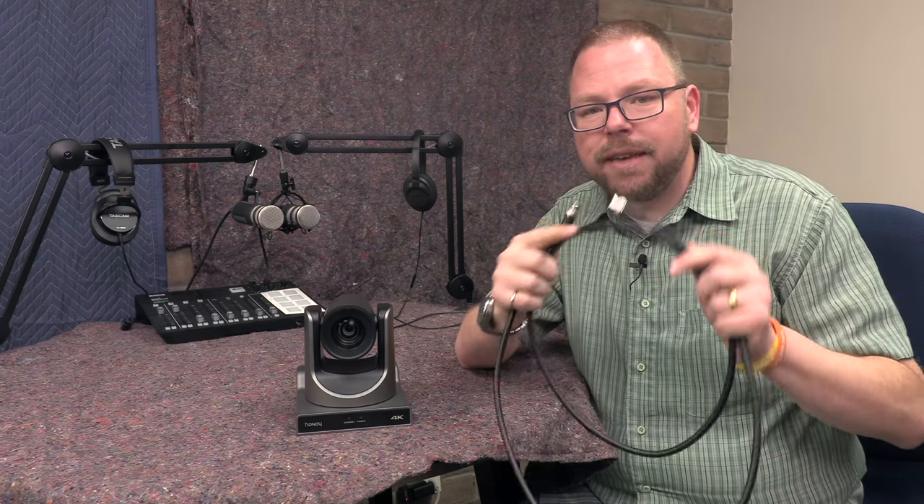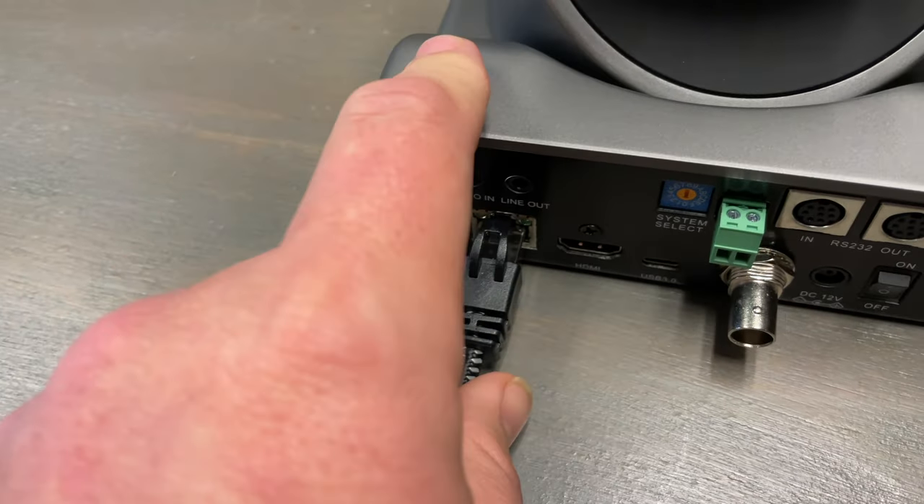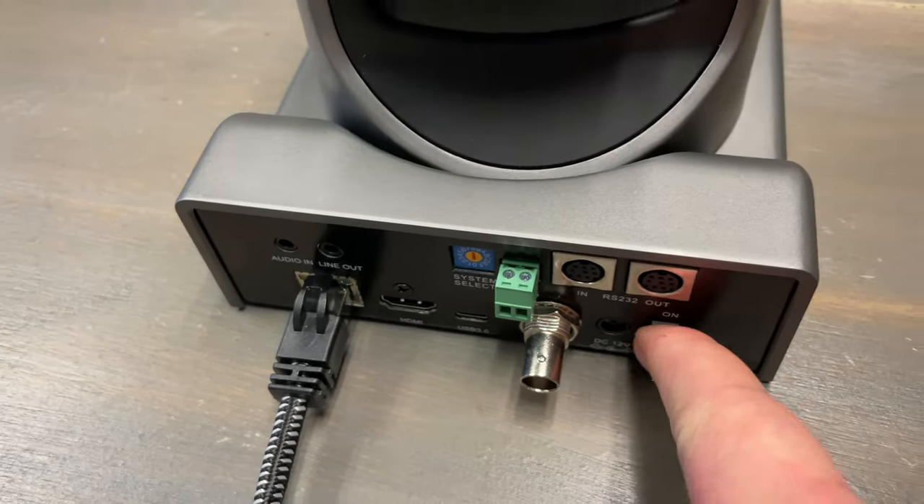These cables can safely be up to 300 feet long. That, if you've watched the NDI video, is going to sound familiar — 300 feet is coincidentally also about the length that your Ethernet run can carry data, and if you're using Power over Ethernet, your power too. So one of the best ways to cable in one of these cameras is to run two cables: one Ethernet cable that's going to carry your data and your power, and then this SDI cable that's going to bring the video signal back.